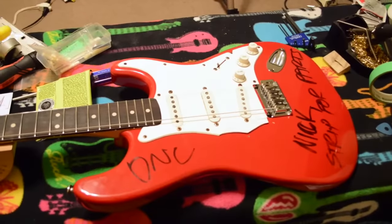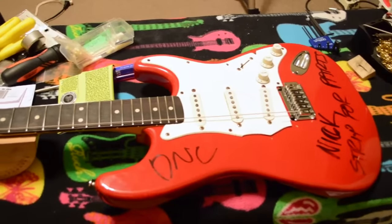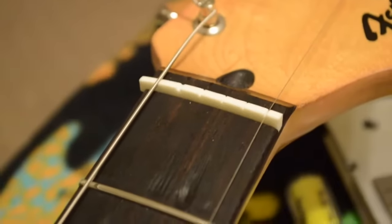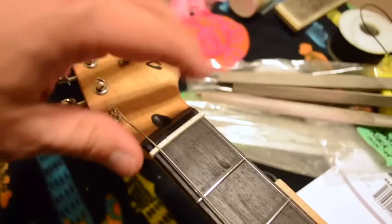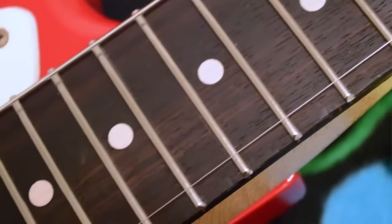As you can see, I got the guitar with the neck on, the pickguard assembly is in, and I'm doing some rough adjustments. Right now I have a temporary nut in there that I'm using to hold in the high E string, just to get some action and set the bridge. Next I'll start cutting the real nut for the guitar.